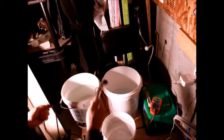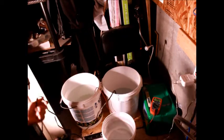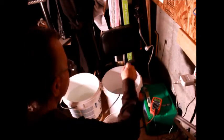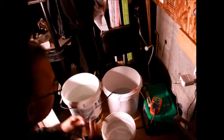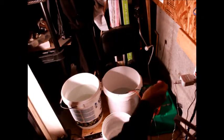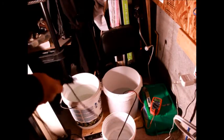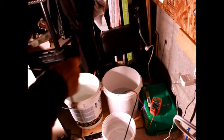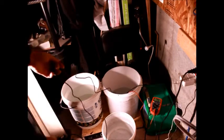I'm going to unplug it - that light bulb is telling me it's not on. Now I'm going to put it in fresh water. Same thing - I'm going to electrify it and get that ground probe ready. Conductivity isn't as good as salt water, but it's enough to protect you when you're having a shower and you drop a hairdryer in your bathtub. Here we go - reset, light bulb's on, plug it in, and as soon as we drop the ground probe in, it trips.